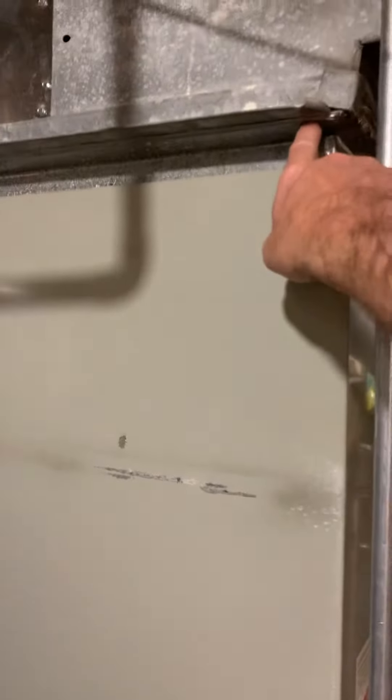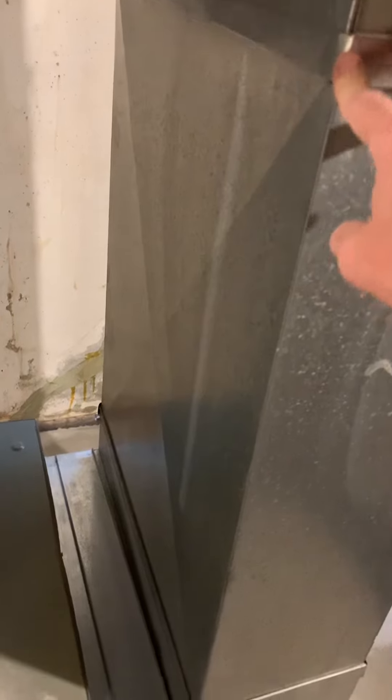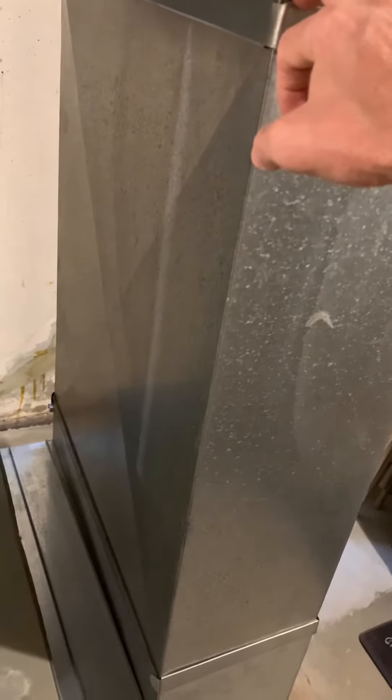So from the top of the furnace to the bottom, the supply is actually 21 inches. And then on the return, I was looking at just going from the floor to the slip and drive here, looking at replacing that portion of it. This would be 10 by 25, down to the floor — I think it was like 54, 54 and a half — gives us some wiggle room.